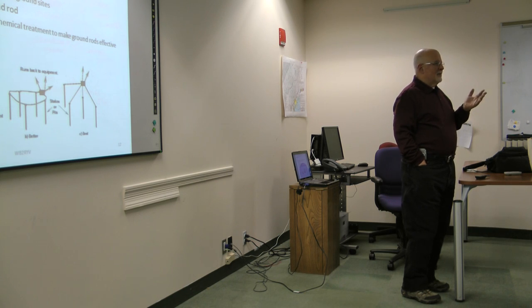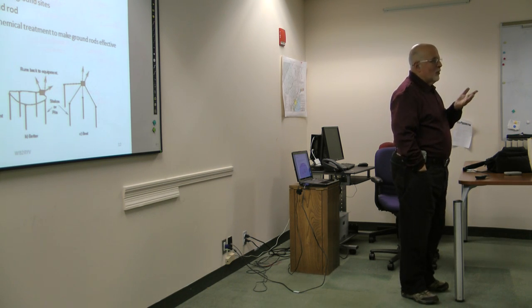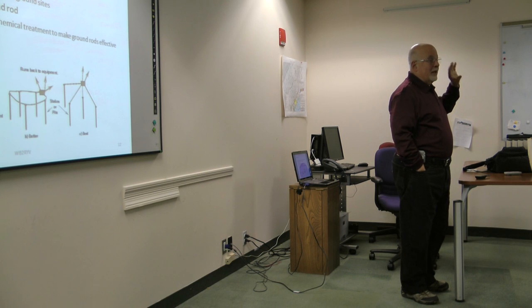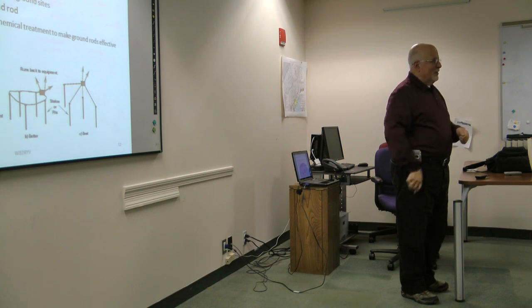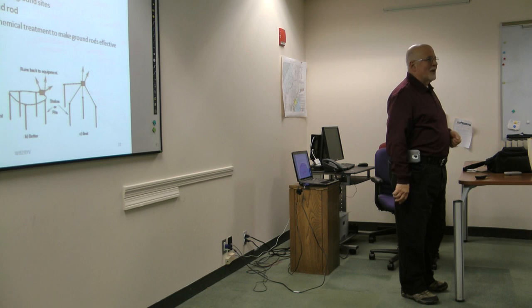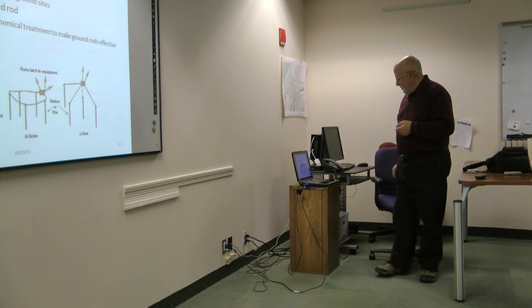But the house has been worked on so many times, and things have been redone. The electrical distribution was redone. Apparently, before I bought the house, I know they had done some major rework of the electricity, and whoever came out and did it just said, yeah, I'll just hammer a short piece of wire, a short piece of ground rod into the ground. I'll call that the ground. And I guess when that was done, which was probably about 35 years ago, nobody looked at it, because it probably didn't meet code back then. It certainly doesn't meet code now. So keep that in mind.